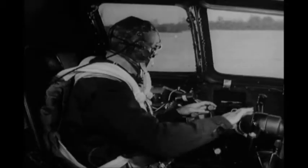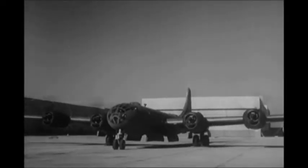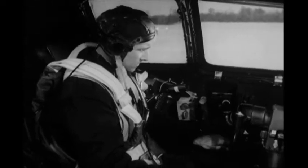You have to push the throttle to 1200 RPM and signal for number 2. The same procedure is repeated until all 4 engines are running. Now that the engines are going, vacuum pressure is available to operate your gyro flight instruments, so the gyro compass and the flight indicator can be uncaged and set. The co-pilot will be doing the same with his gyro instruments.